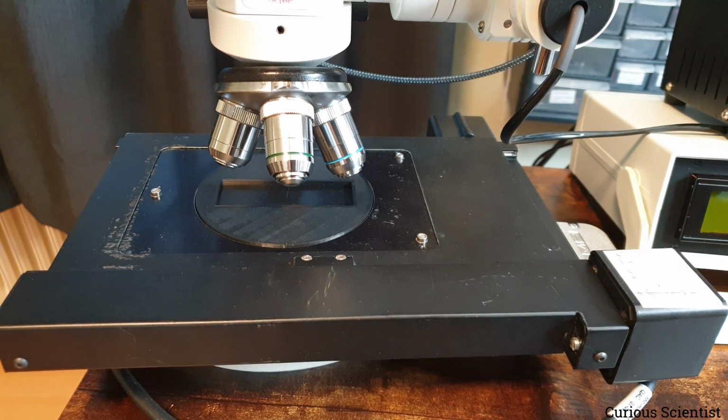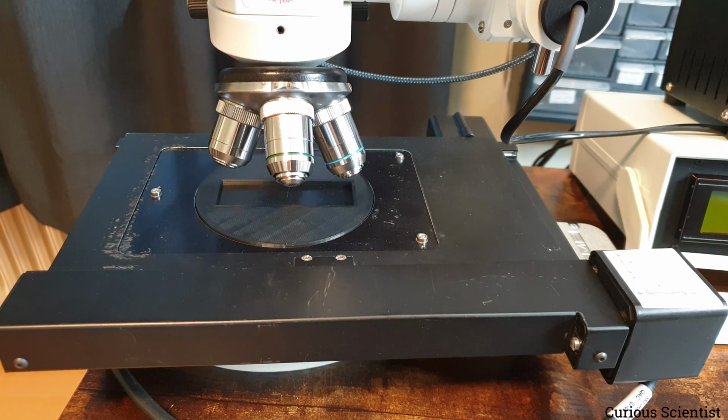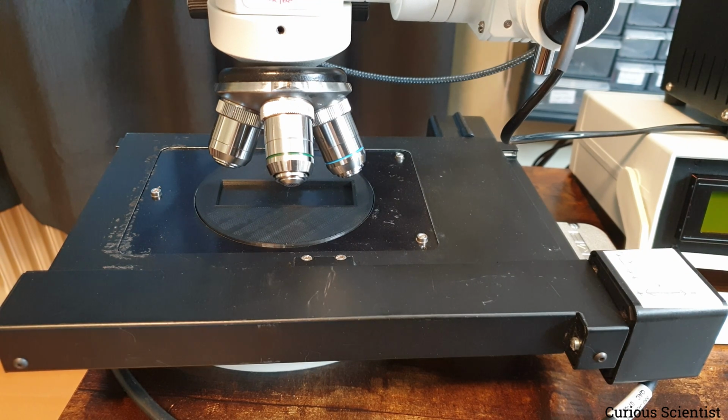And then I also set up the stage and the box in a way that when I home the system, this is actually the home position. Because when it moves to the limit switches, of course the system moves to the extremes and parks there according to the, let's say, default behavior. But then I make the system park in the center.